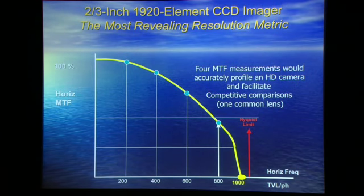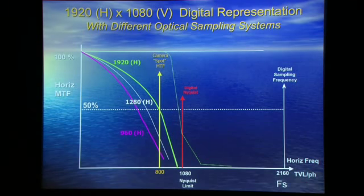It's been suggested that another approach is to quote all cameras at 30% MTF — go to the curve and read off the frequency, calling it a 900-line resolution camera. But it's still a spot measurement. The only way to truly distinguish between two-third-inch high-definition cameras is to make four spot measurements — say at 200, 400, 600, and 800 lines — with a test chart, using the same lens across cameras A, B, and C. Then you can see the lens-camera MTF profile variations and find which camera has a bigger belly in the curve. As you go down in sub-sampling, you will get less MTF, though they all deliver high-definition bandwidth.